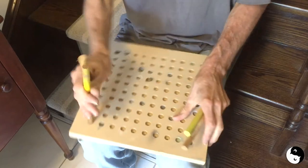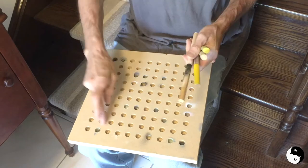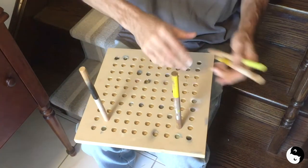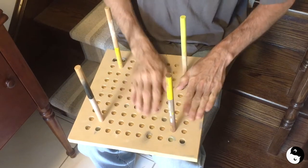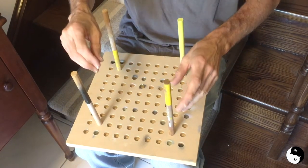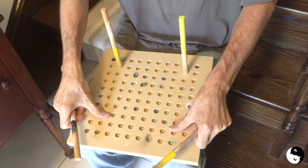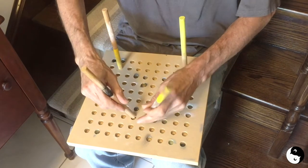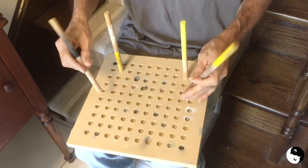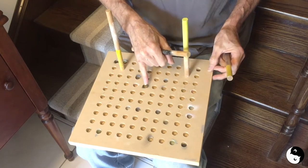We also take a piece of craft paper before you put the dowels in and wrap the pegboard in craft paper, taping it on the back so all the holes are covered. Then you can feel all the holes with your fingers, pick the hole you want, and push through the paper. That keeps the rest of the board clean with no overspray. Next time, if you want a different size setup, you lift the dowels out and put a piece of tape over those holes.